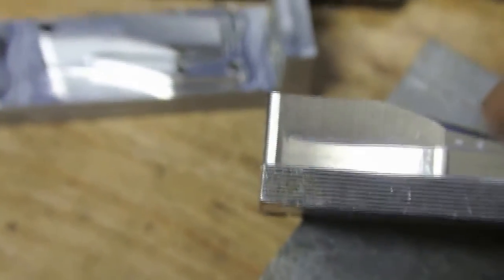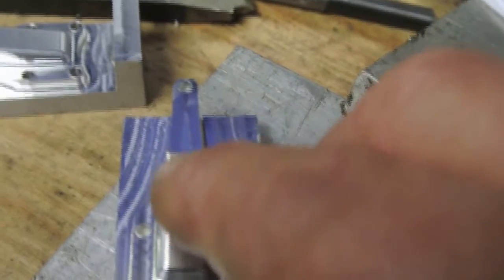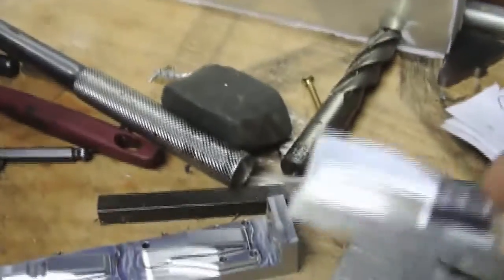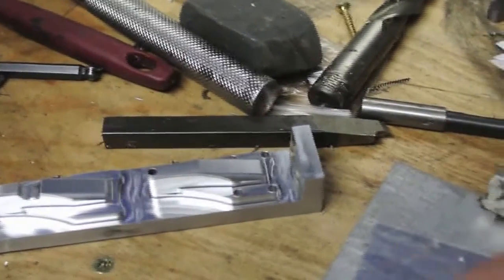On this one, I wasn't very careful where I placed my zero for the start of the operation. However, it's proved the point that that gouge isn't there, and that was the main thing for me. I think the rounding of the corners and the smoothing off has gone a lot better on this one. There's a slight mark — I think that's the tool went across there — but whoever's going to use these will probably dress them slightly. They'll be painted anyway, no doubt. So that's pretty good. Next operation will be to cut the slot in here and then dress off to thickness, but basically the bulk of the job is done with this profile.